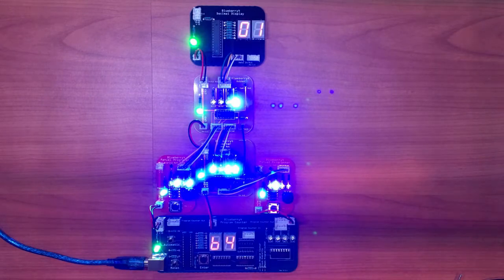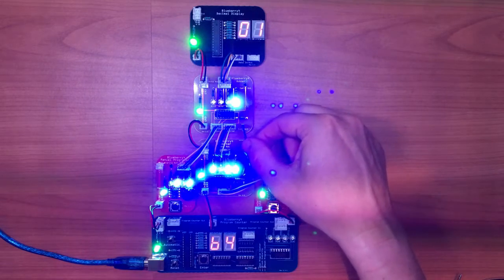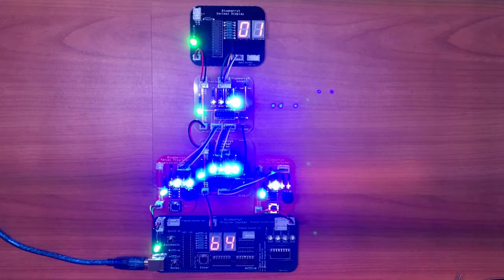We call this the binary complement, and then we need to tell the adder that it has to add a 1 to the result in order to get the correct answer. And why this is the case, we look at in just one moment.